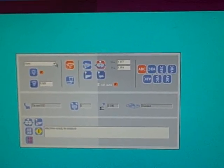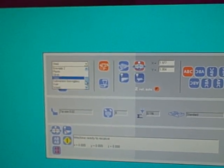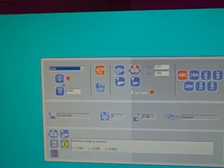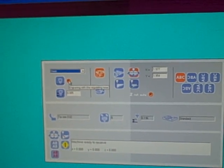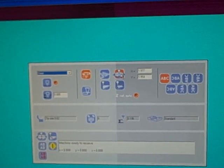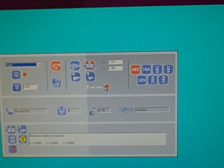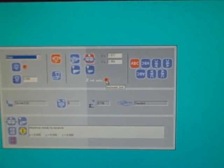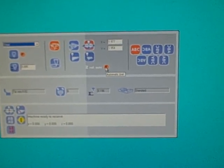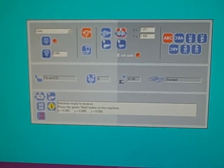I've already selected from the first drop-down box that I want to engrave steel. We're going to use the regulating nose, which is going to set our depth. We're going to be rotary engraving and we have the origin which I have set already. We're going to auto-Z reference so everything is going to be done automatically. The machine is ready to engrave — we'll send the program to the machine.